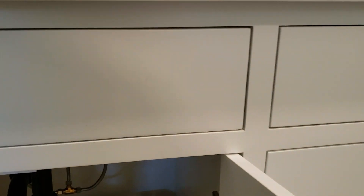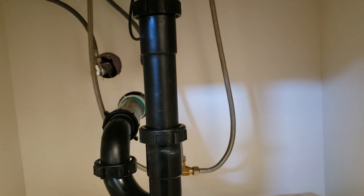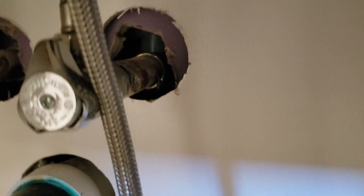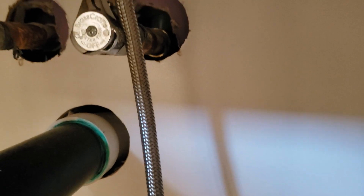Unfortunately, inside the cabinet you can see the holes in the back don't have to be covered, but the sheetrock is not sealed. Normally you'd tape the sheetrock and put some joint compound around the piping to seal it, since it's open to the wall cavity. The building inspector may not like that, so you might need to squirt some caulking in there. Also, the holes are drilled a little high so even a cover plate won't cover them entirely.